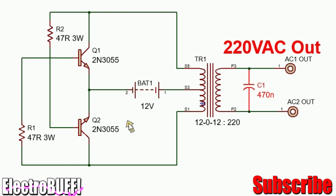The operation principle behind this is really simple. When power is applied to the circuit, either of these two transistors will turn on first. Say Q1 conducts first — it will allow current to flow from the positive of the battery through winding S3-S5, through this transistor, and to the negative of the battery. Current will start increasing in this winding and so will the magnetic flux in the core. Transistor Q2 will remain off because there will be a ground reference at this point, and resistor R2 will pull its base to ground.